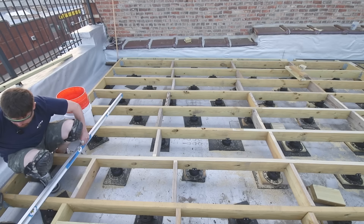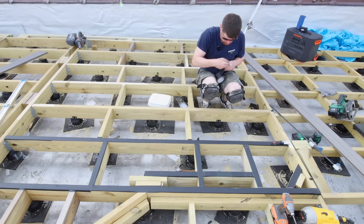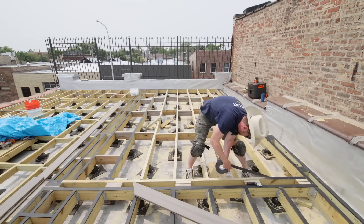For those not familiar with joist tape: you put it on top of joists or any surface facing up where water could potentially accumulate, to waterproof it and extend the life of the deck by supposedly up to 10 years — so it's a pretty important thing to do. One section took an hour and a half. It's kind of like taping off a room with painter's tape — lots of little nooks and crannies. I always scale up and go big without scaling up my time expectations accordingly, when little things like taping become day-and-a-half jobs.